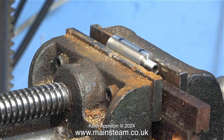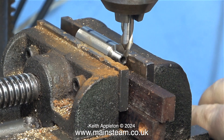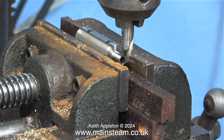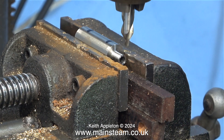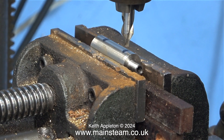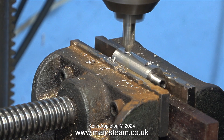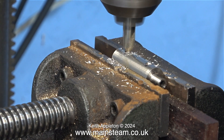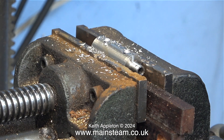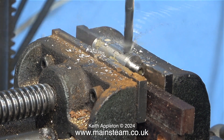Over now to the drilling machine to drill the holes in the barrel. It sat on a piece of mahogany in the machine vice. The first thing to do is to line up a centre drill with the centre of the part. I've moved the centre drill to the end of the part where the threaded bit is — it's easier doing it this way because I can check the alignment easily on a smaller part. I'm currently drilling on both of the lines using a centre drill, which will guide the main twist drill so that the holes end up in the right place.